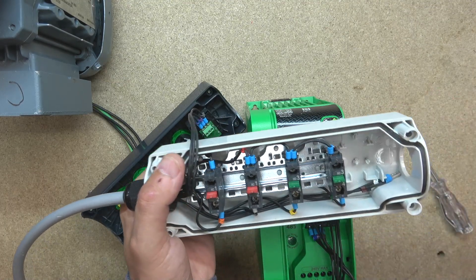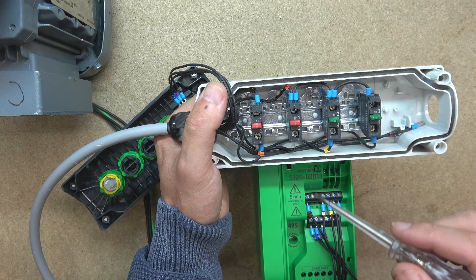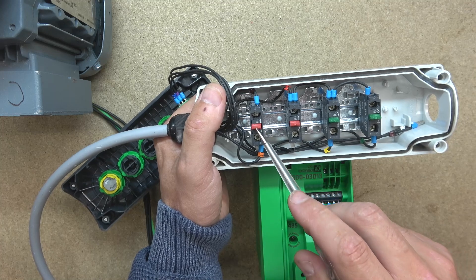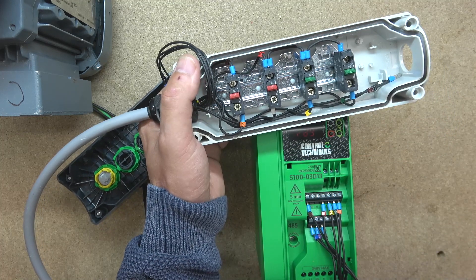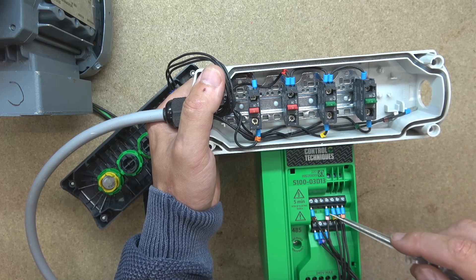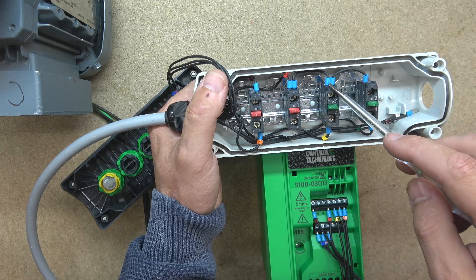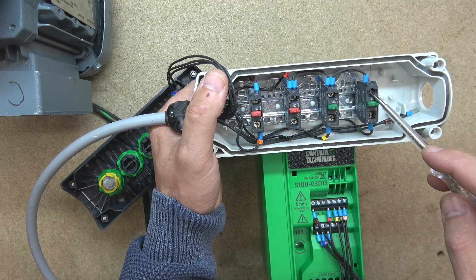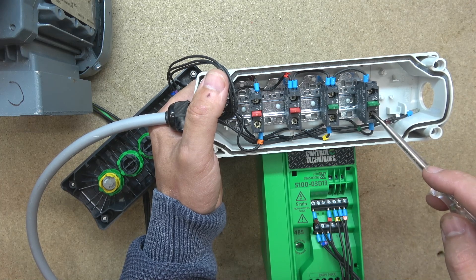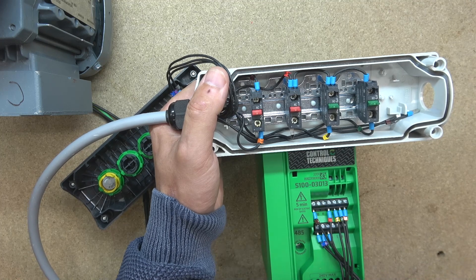When it comes to wiring, it's quite straightforward. I have the 24-volt DC coming to my e-stop, going through the e-stop, and coming back to my hardware enable. As long as that is not pushed, my hardware enable will always be in ready. After that, it goes into the stop — and from the stop it comes back to T12 because that has to be a normally closed signal. From the stop, it goes into the two normally open contacts: one normally open contact is start forward, and the other is my reverse, which has to be kept on permanently if I want to stay in reverse.